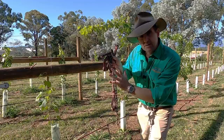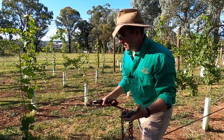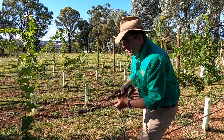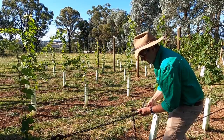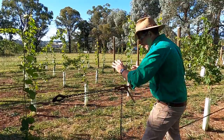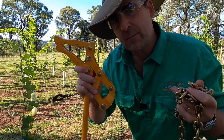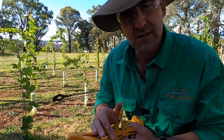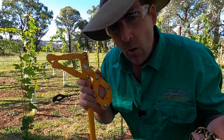Now all of that brings us to the Hayes 108 or the Hayes Smooth Grip strainer. Installing it is a little more of a process. Being two-part, I tend to put the chain end on first, give the jaws a good squeeze and pull to make sure it's holding onto the wire, then while maintaining tension on the chain, install the jaws on your handpiece and engage the second locking cam. The fact that you're using the chain to walk up means that unlike the Donald strainers, these don't have to move on the wire, so you're not abrading the wire or taking any coating off. There's been a flood of copies on the market — some not well made at all, featuring pins that aren't high-tensile and unsound construction methods. Frankly, for the saving of $20 or $30, why would you bother?